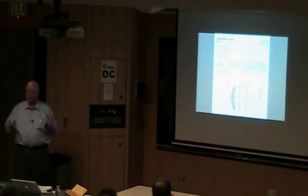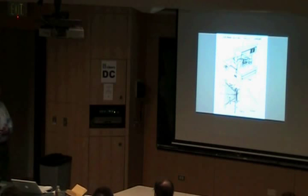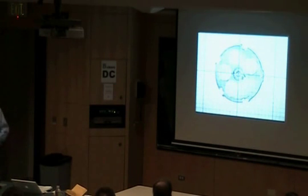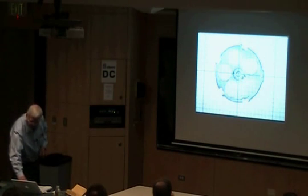There was something called the One Step that was the world's most popular camera for at least 2 years running. That was the white one with the racing stripes on it. But that wasn't quite good enough for us, so we made something else called the Model 660 that had a little wheel here with several lenses on it that could be rotated in position about an axle that would let us focus on 4 different zones. That kind of worked okay, but it had some limitations. The corners were a little bit too dark. There was a little more distortion than we wanted. And with only 4 zones of focus, it wasn't that great for focusing on scenes that got in close.